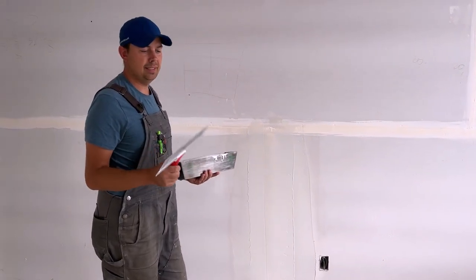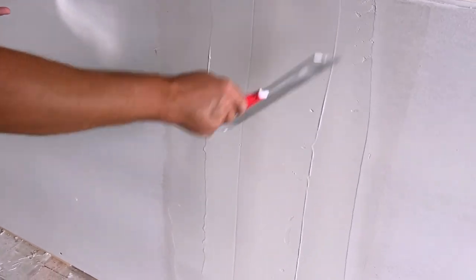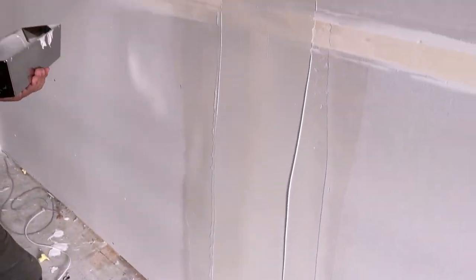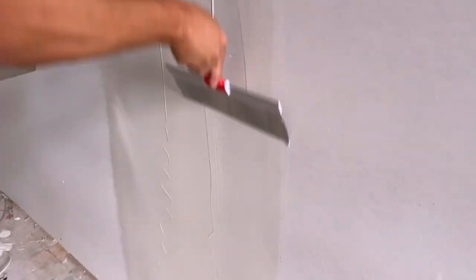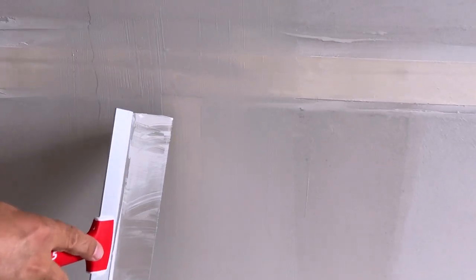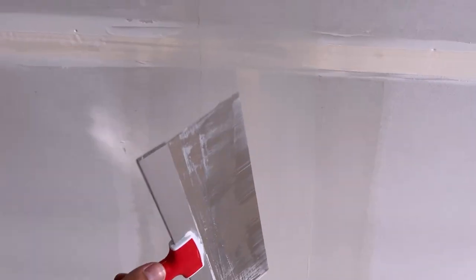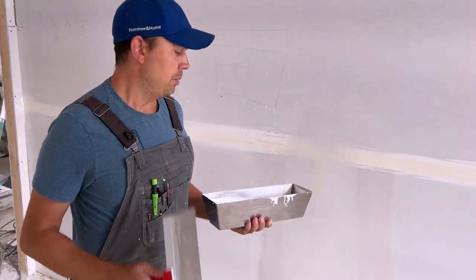Basically with a trowel like this you want to feather off the edges first and then trowel out the middle. This is where it gets hard with a trowel because you've got your edges — you might end up with a little bit of edge along the side, so you want to trowel it out and then come in on your side. Also make sure you don't add too much mud. First coat — not bad. You can see a little bit of flash through there of the tape. This is very sandable, so you come back later, give it a quick sand, and then you're ready for your final coat. This isn't perfect like a professional drywaller would do, but for me this is really good.